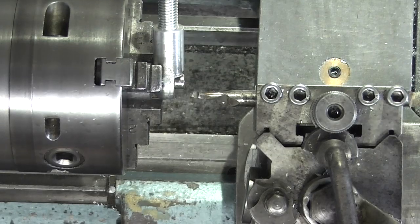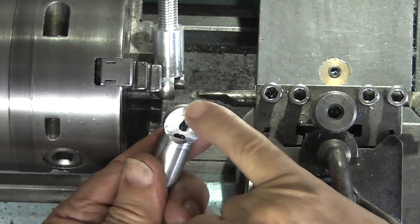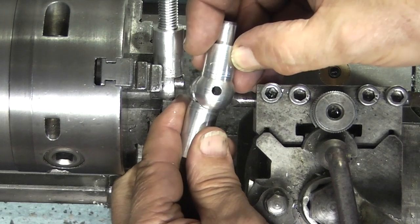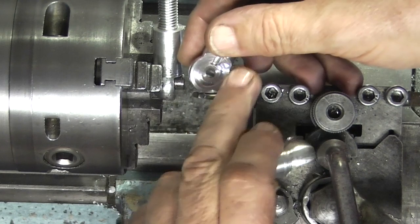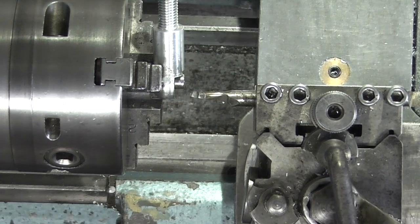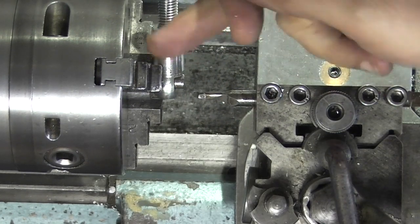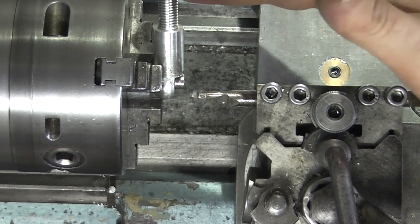So what I'm doing now is machining the last two sphericals, this flat face, making the diameter here so that the spherical will go into that by cutting this diameter, and then cutting the groove all the way around so the cables can go around. Now I've located it in the chuck, I'm holding it on a 5mm cap head, and to stop it spinning it's just resting up against the chuck jaw. So any movement, the chuck jaw will stop it spinning.